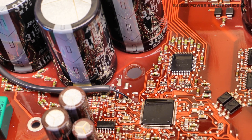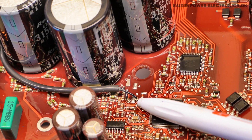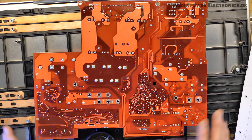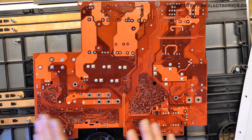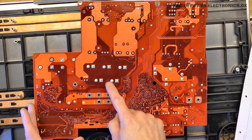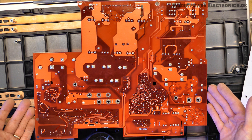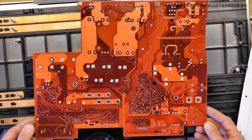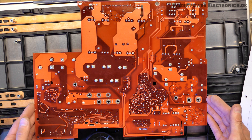Another small PCB art is a little thermometer sitting next to the thermocouple that goes to the heatsink — completely unnecessary, but very nice. On the back side of the PCB, we can see a lot of wires for the low voltage parts with very nice signal separation. The darker shadows indicate this is actually a 3 or 4 layer board, with all power traces running on the back or middle layers, while the top side has very few power traces and is mostly control electronics.